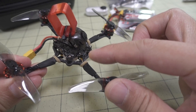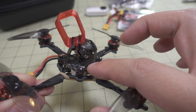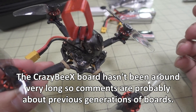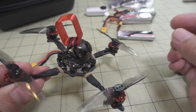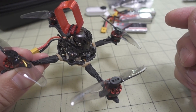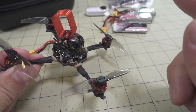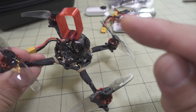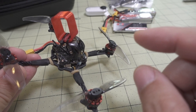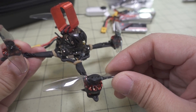There are going to be comments about whether this board is reliable or not. I don't know what everyone's experiences have been with this board or other Happy Model boards. You'll see comments like 'I plugged in a battery and it burst into flames' — that's never happened to me. I do know that if you run turtle mode with the props blocked, the ESCs will fry. I'd be interested to know if anyone claims there's a board better than this one — I'd actually buy it, put it on a quad with props, run turtle mode with props blocked, and see if the ESCs fry.